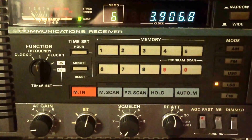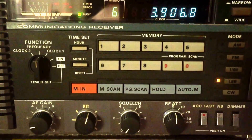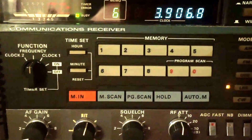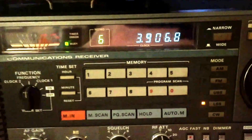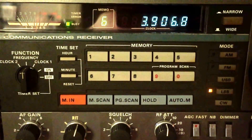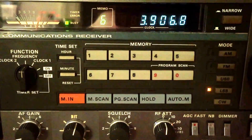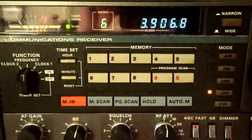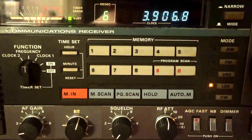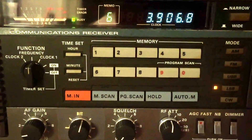So we basically tuned the beat frequency oscillator. I did some research on this and the theory behind it is that the tuning on the R2000 is a little coarse for tuning in single sideband unless they're on a precise frequency. But if they're off, your sound is going to be off. I noticed this until I figured out what this control did — it definitely was off. Really, really happy to have this modification.